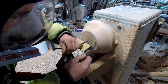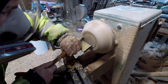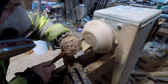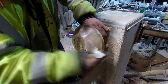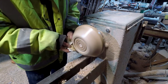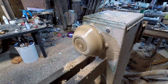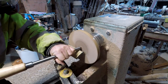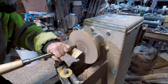The calipers are set to about 46mm, which will give me a 91–92mm recess. Putting a bit of a dovetail on with the parting tool. That's now sanded up to 600 grit and then Yorkshire gritted. And some shine juice for good measure. Just want to flatten off the front face here, doing a bit of shear scraping again. Starting to get the hang of it now.